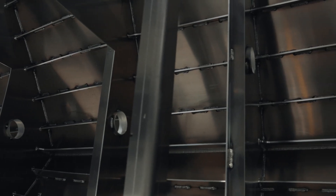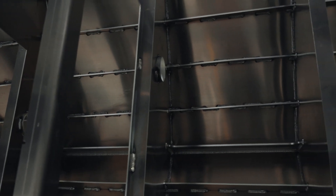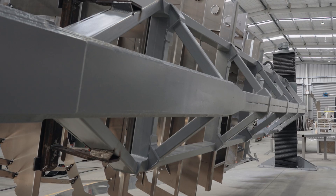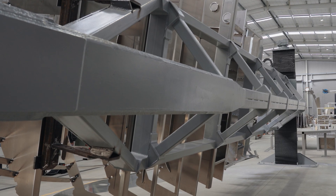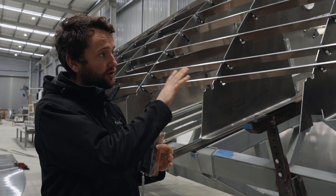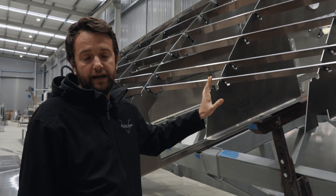So that's where our hull jig is really important. We wouldn't be able to produce our hull shape like we do without building it on a really big heavy steel jig like this. The jig is what holds the boat while it's being manipulated and welded, and then as the aluminium cools after welding it's maintained on this jig and it relaxes into that position.